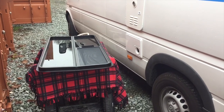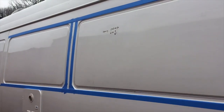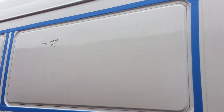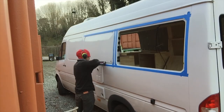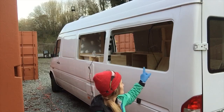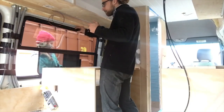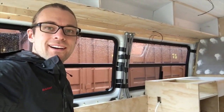Our windows are ready to go in today — we have a relatively dry scenario to get this done. I've marked out my openings at 1308 by 600mm and double-checked them against the windows. We've marked them out inside our interior trim and given them a two-inch radius in the corners. Alright, we're installing window number one — the back window.